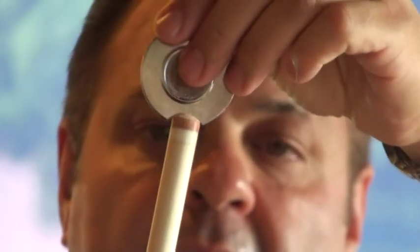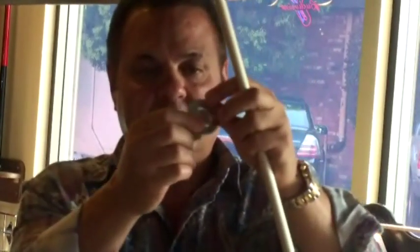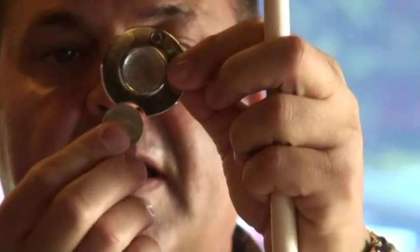The tip looks pretty good. Nickel radius is what we're looking for here. Nickel radius is very important so that your tip has the curvature or the roundness at the top like a nickel. And what we've got here — this is a nickel. If you want to see that you're accurate, you can see that this is a nickel radius right here, just like that. Put this up to this tip. And there it is — perfect. You get a perfect tip shape every time.